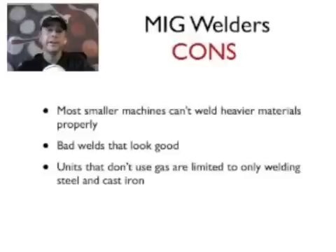Especially for beginners, there's a tendency to really glob on that weld. Since you're pulling a trigger and wire keeps coming out, you just keep gooping up the weld, making it bigger and bigger. Something about our brains tells us that if we see more weld on there, it must be a good weld — and that is not the case at all. It's very easy to get a weld that looks good simply by globbing it up. That's one bad thing: it's very easy to mistake a bad weld for a good one.